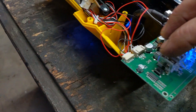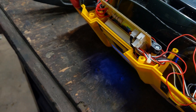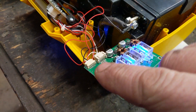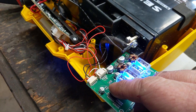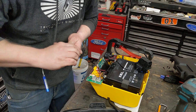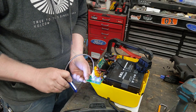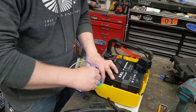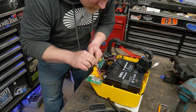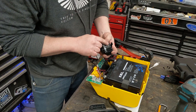Easy enough — good thing it's not in there tight. Push the button and nothing. But now following the wires, it looks like when I was putting the cover back on, I knocked a connector off. So if I just plug that back in — does it turn off? Yep, on, off. Let's plug something into it — just a USB map light. Turn on — yep. Actually feels pretty sturdy. When I was putting the case half back on I must have caught that edge and pulled it out. Put it back together and it'll be just fine, and it does look like it's charging.